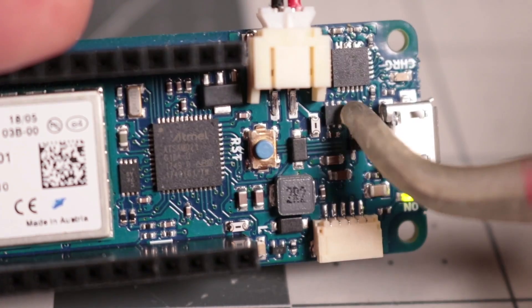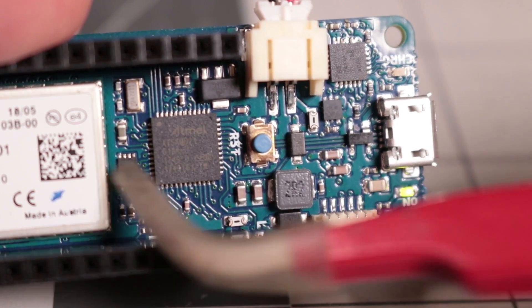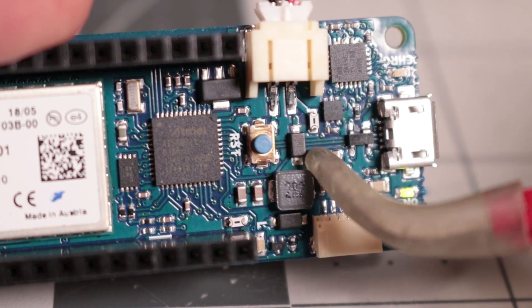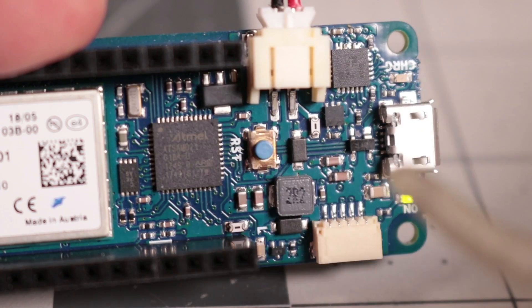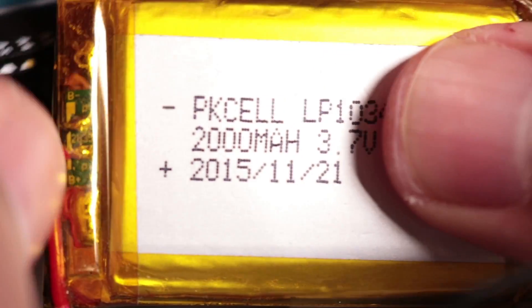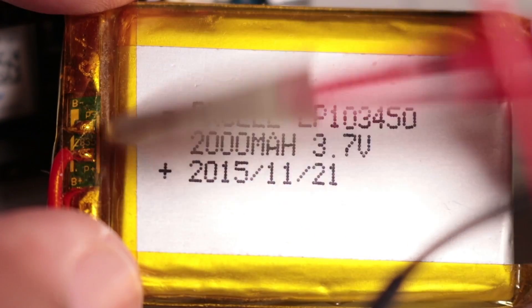The MKR board will handle all of the battery charging and power regulation for the whole board. While I can put the cellular radio to sleep and the main processor, I'll still have the power LED and the quiescent current draw of the power electronics. In order to completely cut power while the LiPo is plugged in, I'm going to be using a slide switch in line with the positive rail of the battery connection. I'm going to be using a beefy 2000 mAh single cell lithium polymer battery that has a protection circuit, which is very important — I don't want this to explode on my wrist.